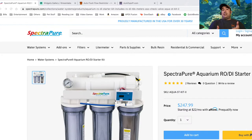You're replacing DI more often. You're replacing membranes more often. The larger the system, the less maintenance. So the answer to your question is, what's the minimum stage? The minimum stage is, I highly recommend a four stage. I think a three stage is a little bit too small. A four stage is going to give you everything you need.